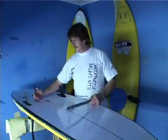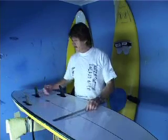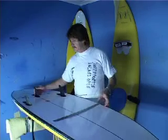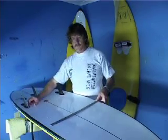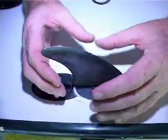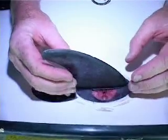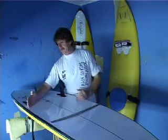In terms of speed we have gone for a different kind of fin system. We have gone away from the classic wave ski skate box with the slide backwards and forwards. What we have gone for is a new concept called a four-way fin system. The concept is from surfboards. The idea is that you can adjust it radially on a fin — you can turn it this way, you can also slide backwards and forwards. So you can adjust your toe in; you can have toe in if you like, or you can have toe out.